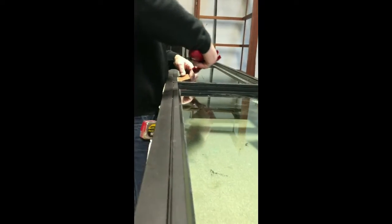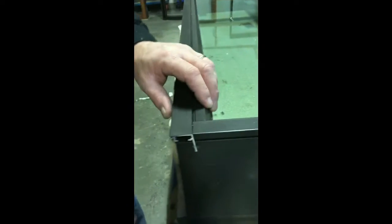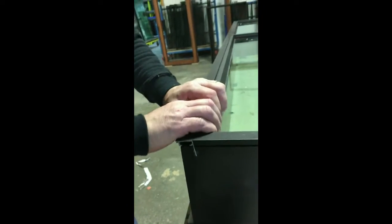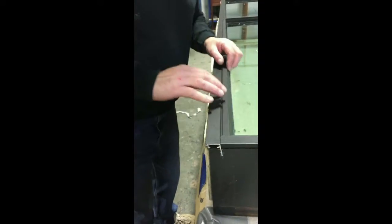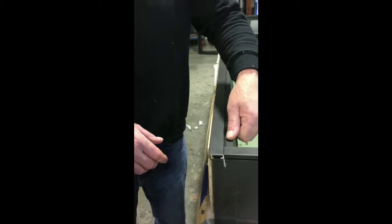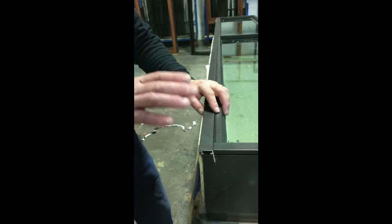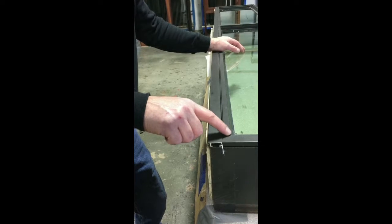If you didn't think it was in — what if you're proud? Like this guy's a little proud. It usually won't be — it varies, it's not exact, it's not 100%. How hard did I push that clip in? It's all about that clip. And the reason why the corner windows are so hard to cut is see how this guy doesn't lay flat? It's a double compound miter for the corners — and that's what the glazers struggle with.